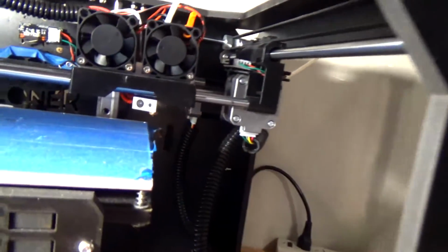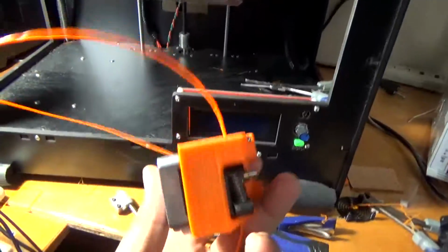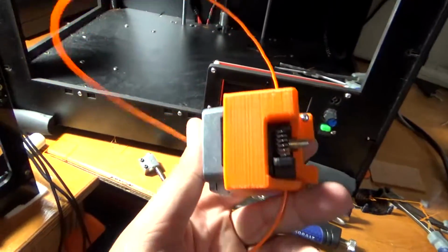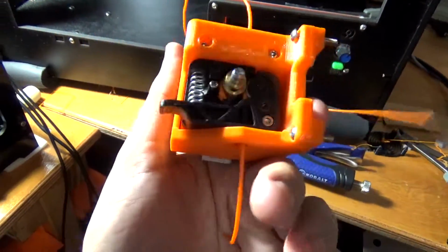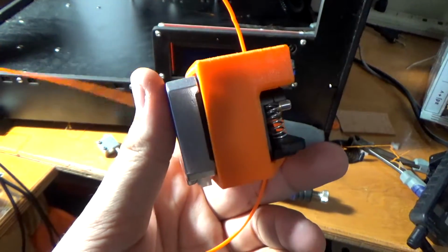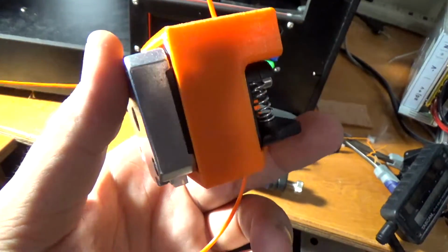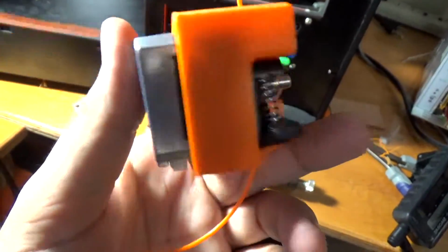It's also the Y motor, the one back there. It's one of these motors too. No, it's the Y motor on the Prusa as well. It's the bigger of the two motors, of the two sizes. Anyway, usually with a Bowden style extruder, you want a bigger motor, but this one I just put on there to do testing, and it did work fine for most prints. But this print I was working on was like 3 hours long, so about an hour and a half in, this thing just got way too hot.